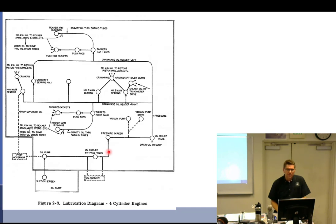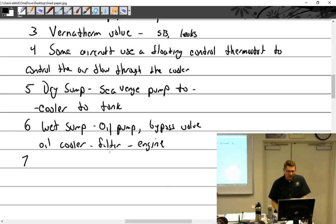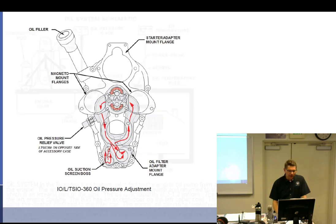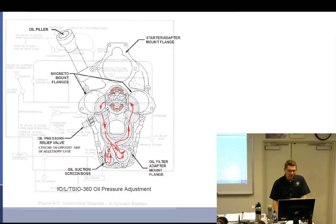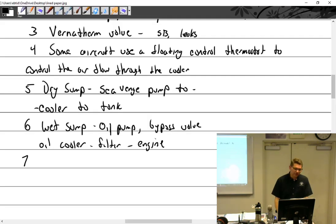I was talking about the one that had the galleries that you were trying to explain. The textbook one. Oh, yeah, the one from the textbook. Well, this one for sure is a Lycoming, and this one is a Continental case, you can tell by the oil sump. But it's just a textbook. Could be right, could be wrong. Looks like an O-300. Oh, that's right, thank you. Because the camshaft is on the bottom.